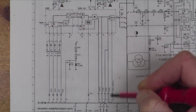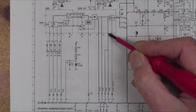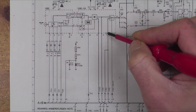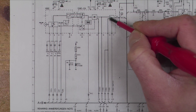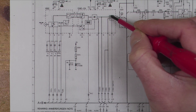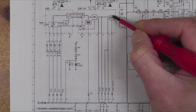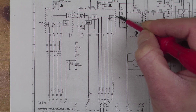Here's part of the circuit. The composite input comes in here, it's connected in parallel with the composite input from the SCART socket, and it goes to the IF and sync module. It enters at pin 13 and goes to a switch. The other input to this switch is the demodulated video from the aerial. It exits at pin 16.